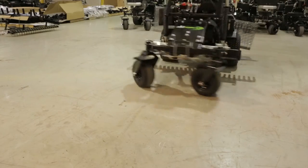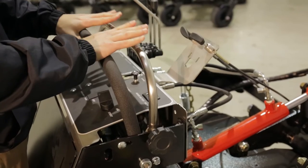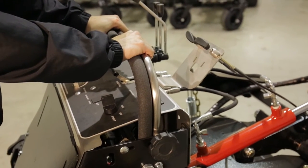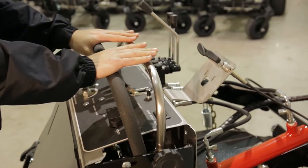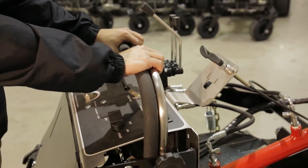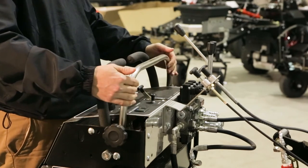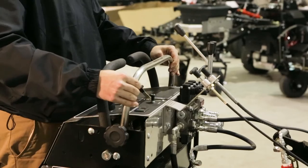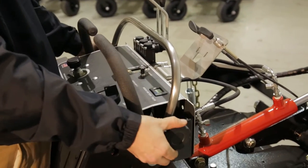For a quick zero-turn maneuver, move the operational levers in opposite directions. For consistent results on any job, an adjustable squeeze handle is positioned as a governor, keeping operation speeds steady and dependable. Loosen both knobs on either side of the squeeze handle to adjust towards or away from the operator for slower or faster speeds respectively. For safety, please make adjustments when the ABI Force is completely stopped.